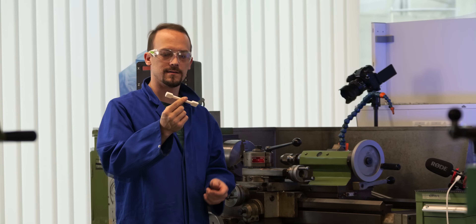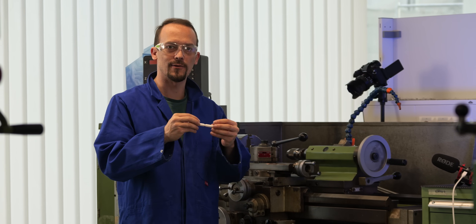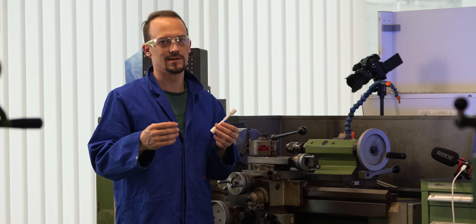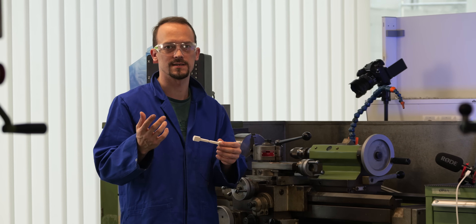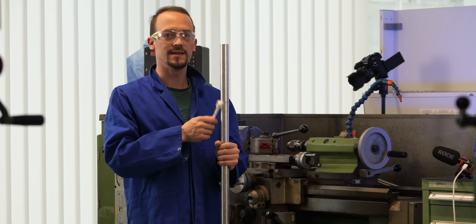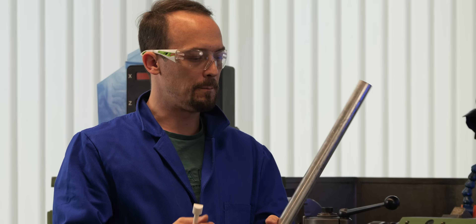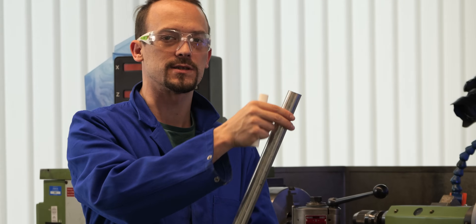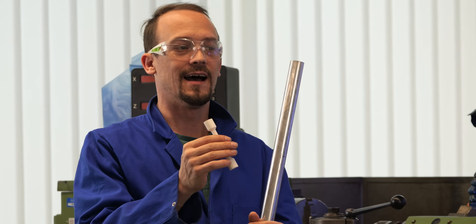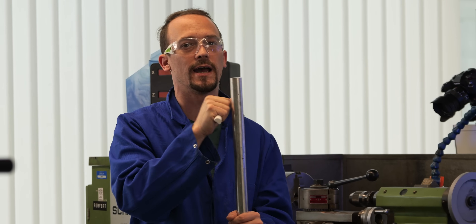We have our testing parts now and we need to somehow attach them to our pull testing machine. Because we went with a custom form, we have to make custom holders. The machines are mainly used for biological samples or gels. So I've got a bar of aluminium here — a little bigger than needed — and we will manufacture our attachment out of this to eliminate any kind of stretch. If I had 3D printed those attachments, we could get elastic or even plastic deformation in the holder itself, so that's why I'm going with aluminium.